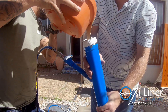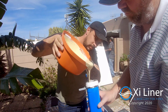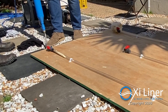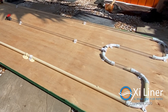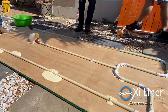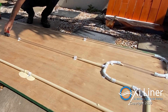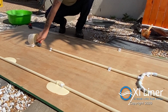The tube must always be in an upright position with the outlet at the bottom. The epoxy is then poured in through the top with the pressure cap removed. The idea is that the air pressure pushes the epoxy out of the tube and through the line to the closest open point. So on a multiple-point system you would open one valve at a time and the epoxy would hit one valve and then travel to the next through all the T pieces, filling up all the holes along the way.